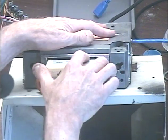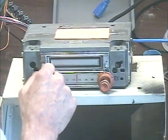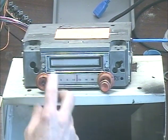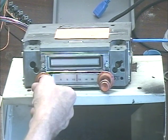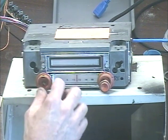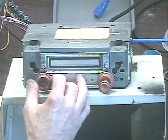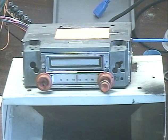Okay, pull the tape out. Radio should come back. There's our radio back. Alrighty, and that's everything. We've tested all the functions, and the ones that will work on this radio do work. The only thing we don't have is that virtual front-rear fader because of such a limited travel of this radio's tone control. Tone control normally has about at least 300 degrees of travel. This has probably less than 100 degrees of travel, so there's just not enough range there to activate that function.